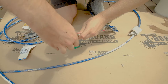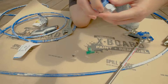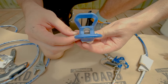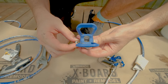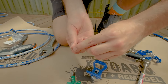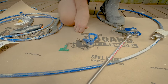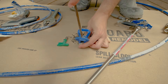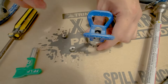With our spray guard, as it comes standard out of the kit, there's a OneSeal in there — you can see it has a much bigger hole than the one for our fine finish low pressure tip. This is a gasket that tightens as you screw it back against the tip extension or spray gun. What we're going to do is poke this out. This is also really important for cleaning — over time, paint running through the back of this rubber seal can cause spitting. Use a flat head screwdriver, a pen, or a pencil to poke that through. Push it through the top and it comes out. We've got a separate video on how to do this.